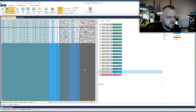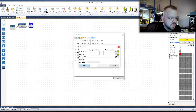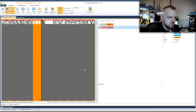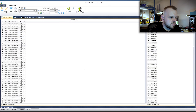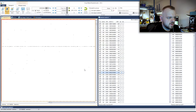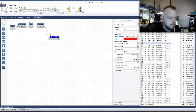I'm just figuring the size, and here's the size. Now I'm just gonna copy and paste everything down. The last thing to do is set up the system area — this system area also has error corrections, so we gotta add that in as well. We know the size now, so we can try some things. There was a bit of a problem at the end, so we just had to correct it a little bit. When that was corrected, you can see it's green — looks really good. I was thinking this drive might have XOR, but it didn't. I'm using my method of using a markers table to find XOR, trying different ones — but no XOR on this flash drive. Error correction went really quickly. Usually this is slow, takes days sometimes — this was so fast. There's nothing to correct.